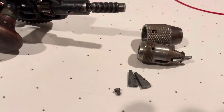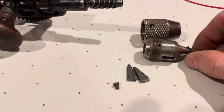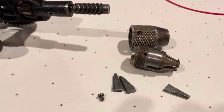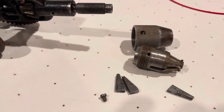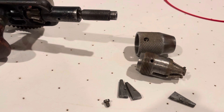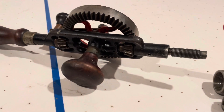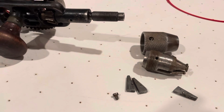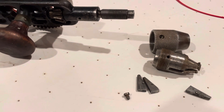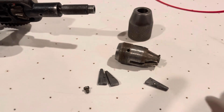I really like this design. Unfortunately it does not take drill bits that are one-quarter inch in size like other chucks used on Miller Falls — this one goes up to three-sixteenths. Honestly, if you start using quarter-inch drill bits in a hand drill, you might as well step up to its big brother: Model 2, or the one I actually prefer, Model 980 — or maybe 1980 — the one that came with two speeds. That's a little tidbit about the McCoy chuck.